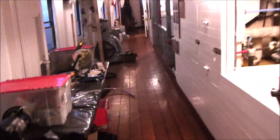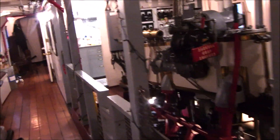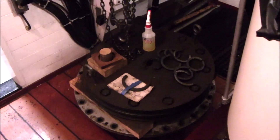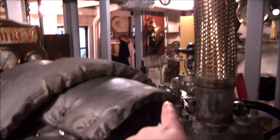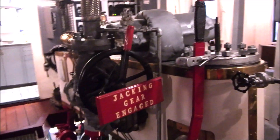Good morning from the Virginia Five. Having another fun day in the engine room. Sorry for the wind noise — it is very stormy here in Seattle today. In the engine room today we will be reinstalling the low-pressure piston, which should be basically the reverse of getting it out of the engine. And then taking off the heads of the intermediate pressure piston and the high-pressure piston to inspect them. They hopefully won't need to actually come out of the engine.